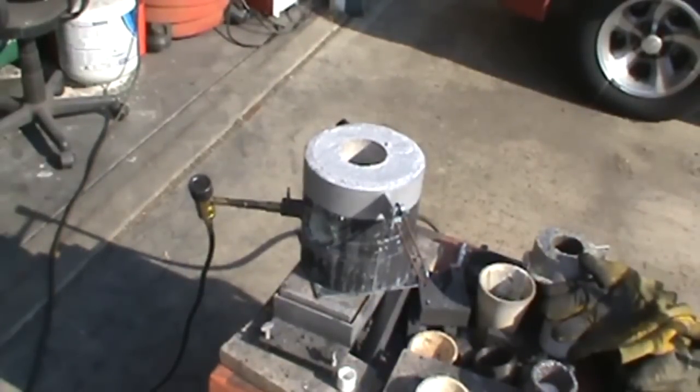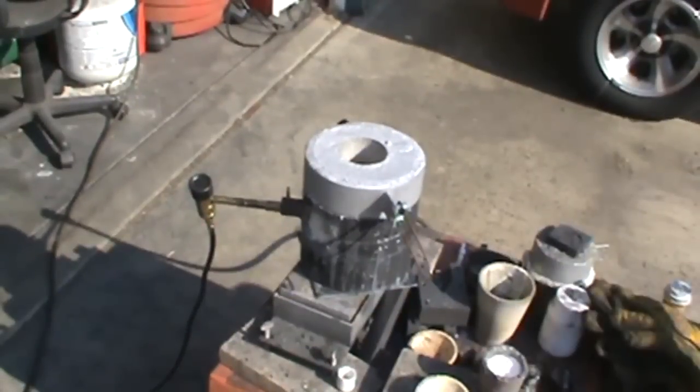Normally to cure this in an oven, I'd cure it for four hours at 250 degrees and two hours at 375 degrees. But today it's getting two torches on low fire for probably 20 minutes. The Kaowool inside is just about ready — it's been curing for about 20 minutes now, just starting to glow inside. It just had to get all the rigidizer liquid in it to evaporate.